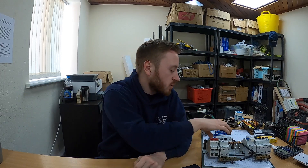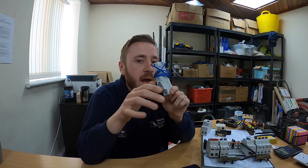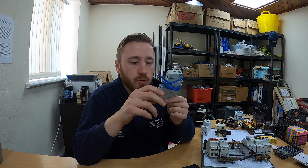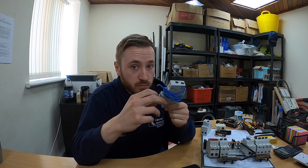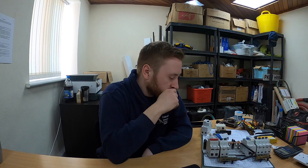An RCD module would normally cost about 40 to 50 pounds or so. But you may have one of these, which is an RCBO — a very high-spec part of a fuseboard. The same principle applies: the one supplying the electric vehicle charger will need to be a Type A. Once you determine that, you can rule out straight away whether you need a fuseboard upgrade or not.